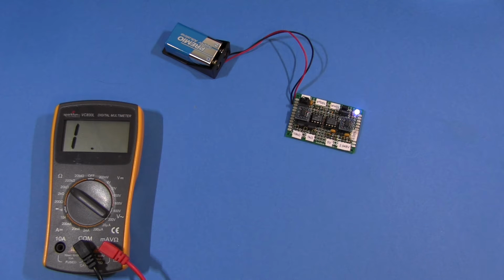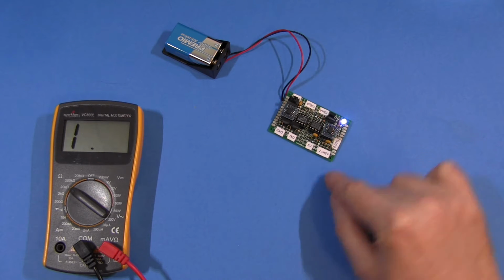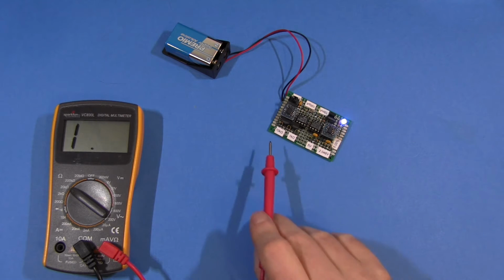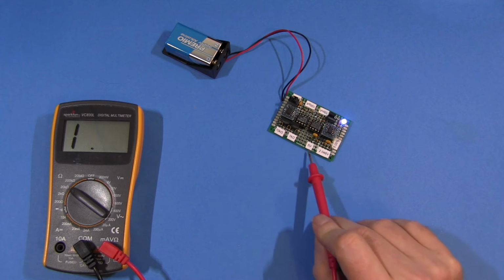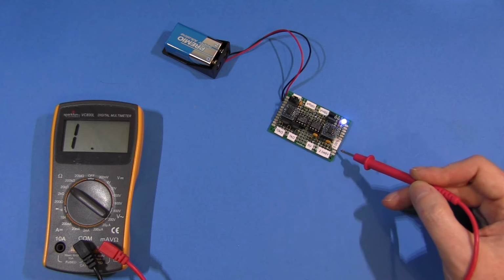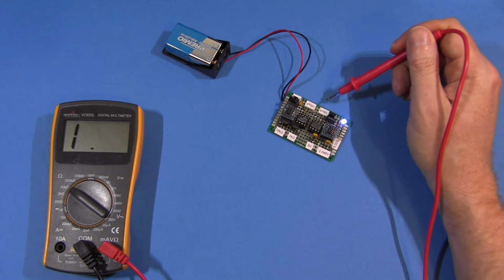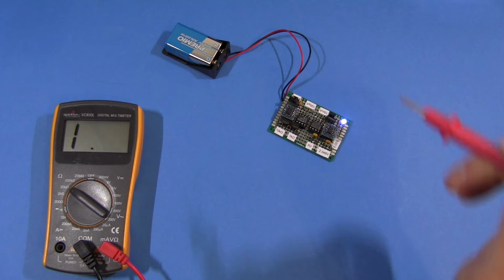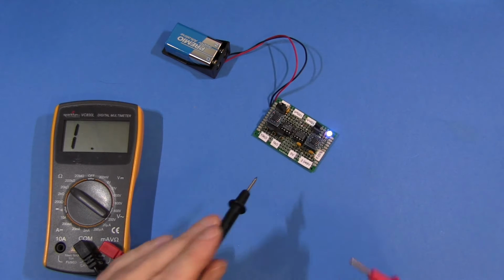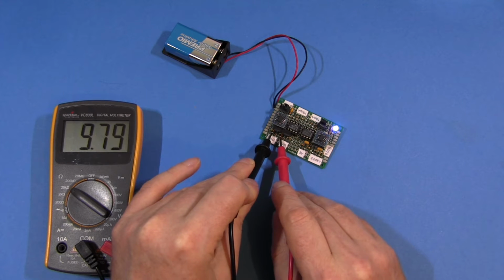And let's do some electrical measurement tests. I've got a little board here with some precision references on it. We've got ohms, volts and amps, 2 of each. For the ohms, we've got some precision resistors on there, 0.01% tolerance. For the voltage, we've got some precision voltage references, 0.05% tolerance. And for the amps, we've got 2 precision current sources, 0.5%. Not quite as much, but still pretty good. And let's start with the ohms. This should be 10k ohms. Get it in there.